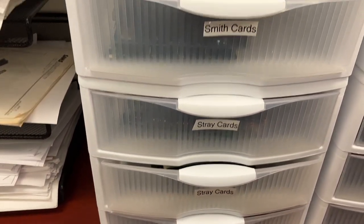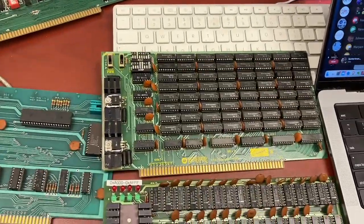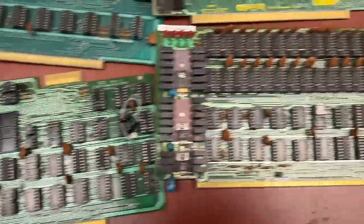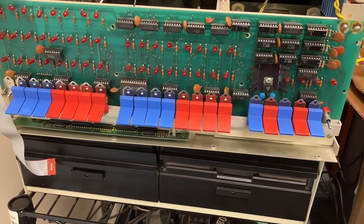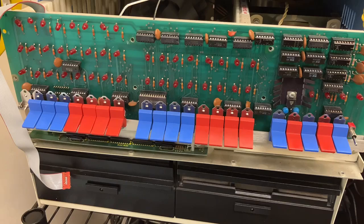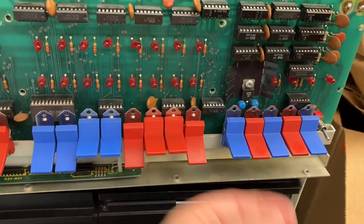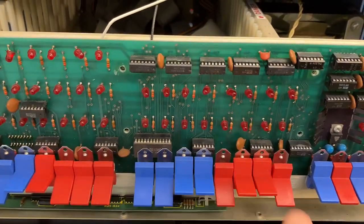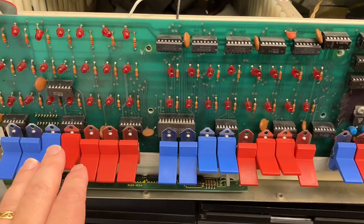I have a large collection of these cards because I'm kind of obsessed with S100 bus computer systems. The goal would be to test out cards and repair them, make sure they're working, and build computers out of them and have them do cool stuff. This is a good project for learning the Z80 instruction set. The Z80 was one of two processors very popular in the late 70s and early 80s, the other being the 6502. You can actually enter information into the machine with these switches in binary and read the output in binary, although generally you would hook up a terminal.